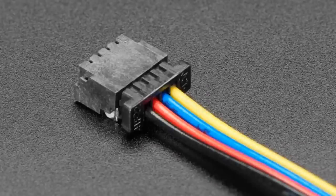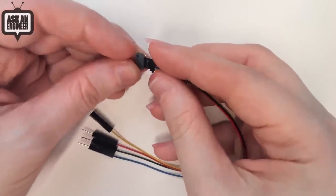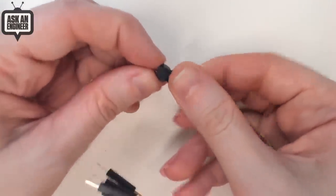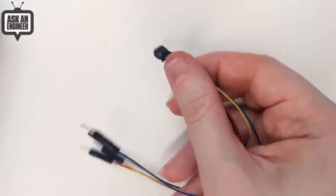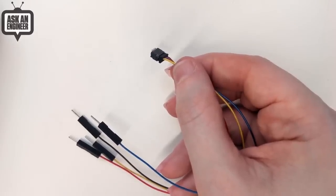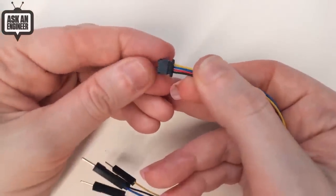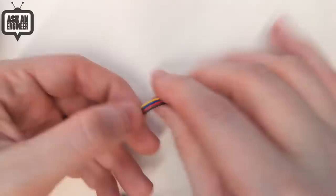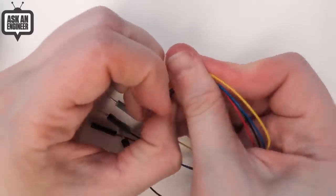Yeah, and then one thing I should let folks know, we decided, let's support Qwiic, let's support Grove, and then we have Stemma and Stemma QT. So the way we've worked on things and made things is if you use Stemma, you can use all of them. Stemma is very flexible, because it doesn't require any particular voltage. It has level shifting built in. We didn't want to have a whole other new standard, and we also wanted to support everything out there. So if you have Grove stuff, Qwiic stuff, you can use Stemma. And this is nice because this cable that we have just brings it out to blocks. You can just plug them into a breadboard. Of course, it's hard to remove it because it's not soldered into something.